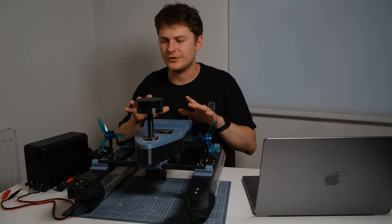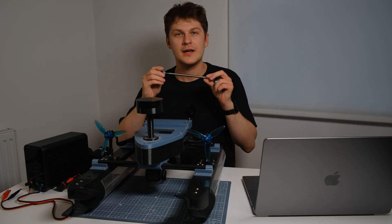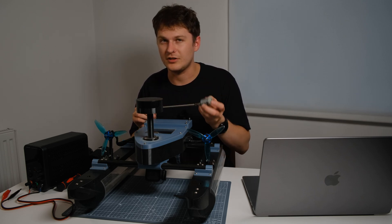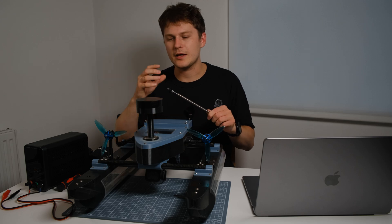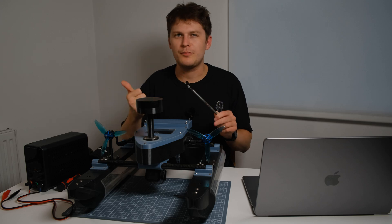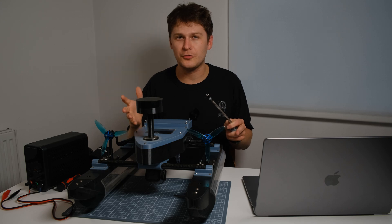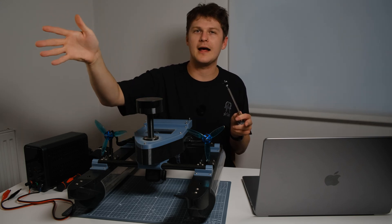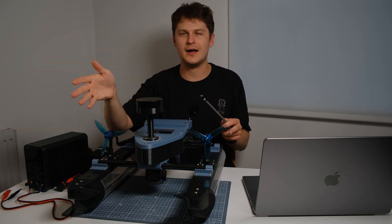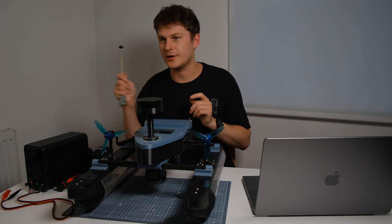The main thing that really sets this boat apart from others you've probably seen is its propellers on top. I did originally start with normal propellers using a brushed DC motor, but the problem was they moved the water a lot and got caught up in weeds. Being in a canal means very shallow water with a lot of random things around — you just can't afford for it to be 200 meters away, get caught in reeds, lose power, start drifting, and have a canal boat go over it and destroy it.